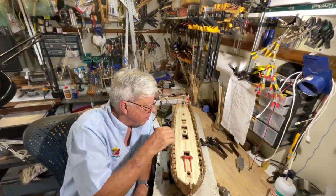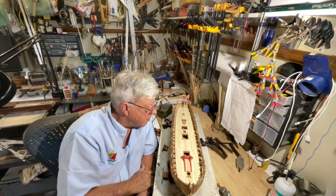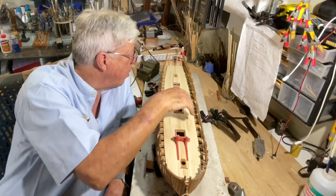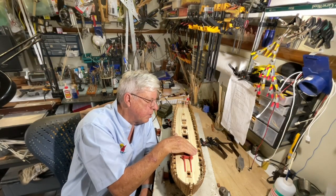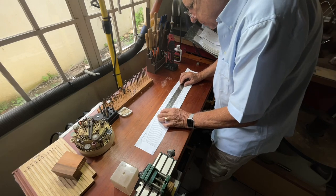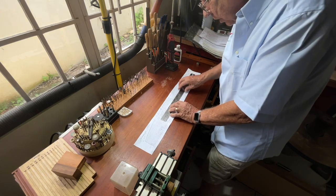I am very happy with the way this has come out. The first two difficult tapered floorboards, I was able to match the pieces, the companion pieces, and I've got a nice clean line from the bow all the way down to the stern. Now we're going to tackle the last two pieces, and that's going to take us close and lock off the waterway. Before we tackle that, I just thought I would put the ruler on it, and what it shows is that we get a nice straight line to install the last two strakes.